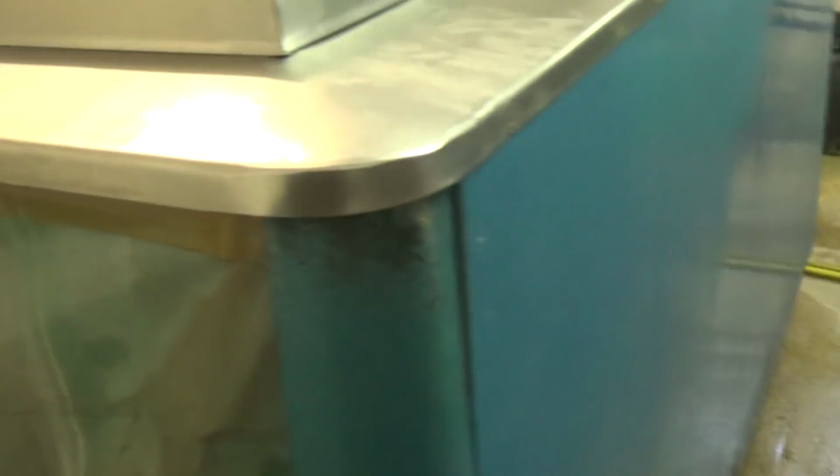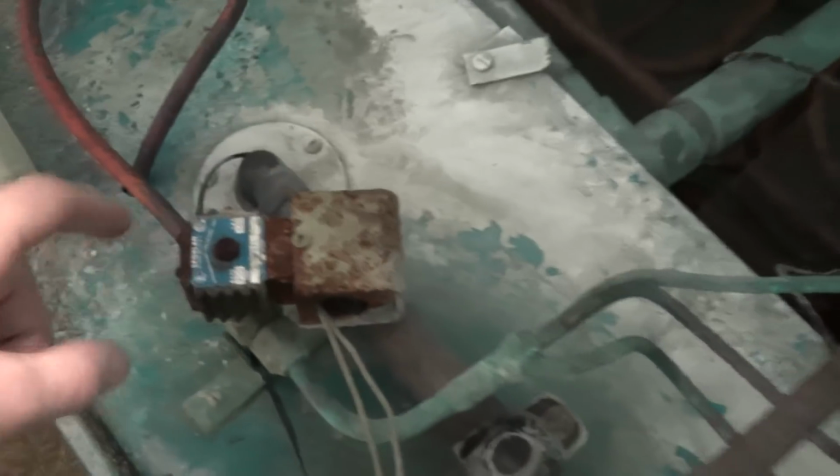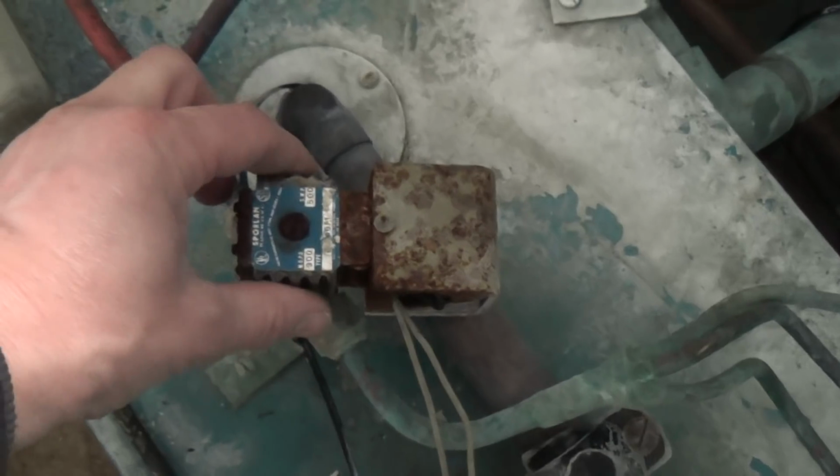This is on an old Alfa Laval milk tank, old blue fiberglass on the outside. So you've got three coils in there, three separate circuits, two water pumps to pump the water around. That's your solenoid there. They're quite odd because it's got a distributor to split the feed up before it gets to the valves. That's the only place I've ever seen that done. I mean it works, but anyway, that's our valve. It feels cold, so it should be warm if it's calling for cooling.